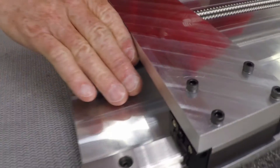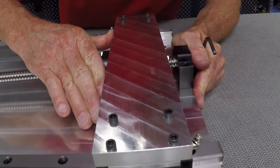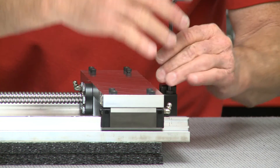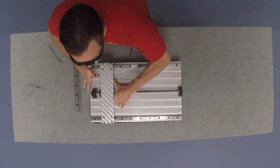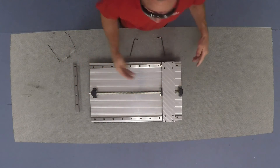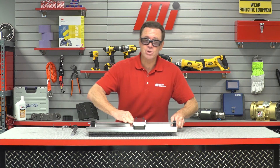What we want to do is slide this all the way to this end, then put these two screws in, and we'll be good to go. We make sure that it's operating smoothly and stroke it back and forth. And now we have a properly aligned ball screw that's on its way to a long life of smooth, low friction performance.